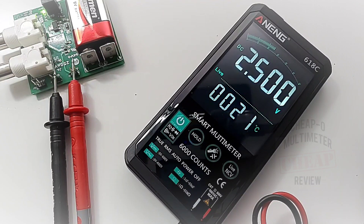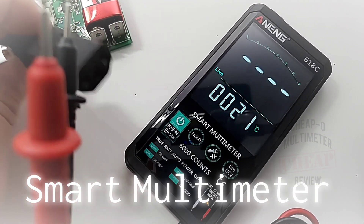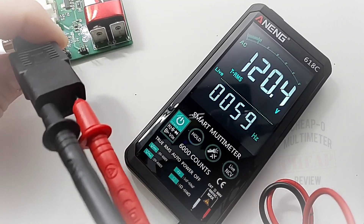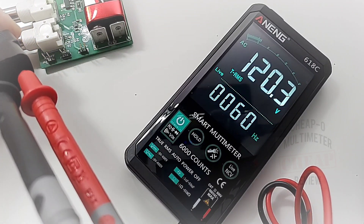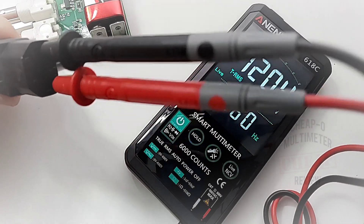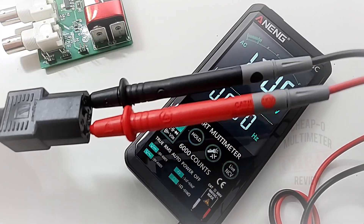For instance, from DC to AC — let's try that right now. We're in DC mode and we're just going to take our test leads to a live 120V AC outlet. I'm not changing anything on that meter, and — bada boom bada bing — 120 volts AC. So that's a nice touch: not having to fool around with the selector switch. If you're in a jam and don't want to play around, it's going to do it for you. Very cool.